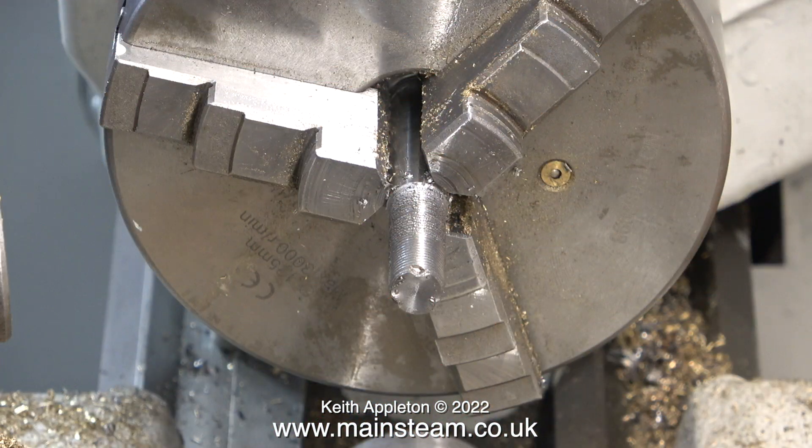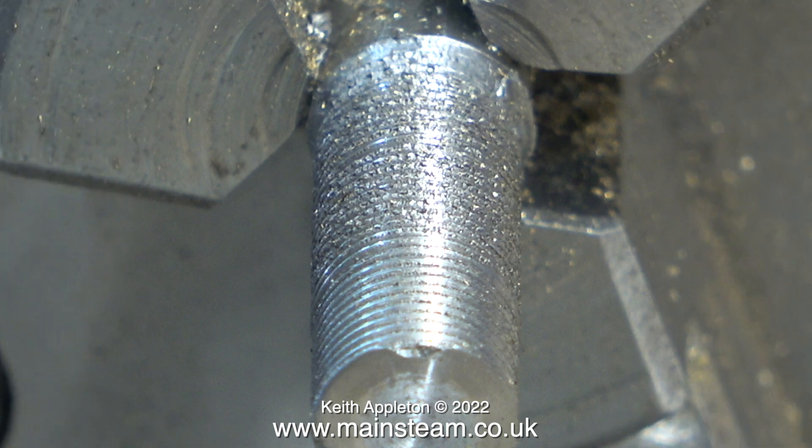Now in this image you will see three things wrong with the work. The end nearest the camera has been chewed up by the tailstock chuck — I faced across the front of it just to make it look better. The first bit of thread doesn't look too bad at first glance, but when you look closer the outer edge of the thread is flat, because I turned it under size. The rest of the threads on this piece of bar, which was turned to the correct diameter, are really bad.